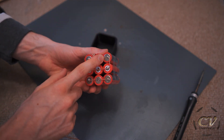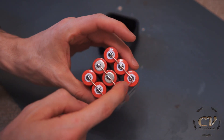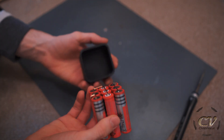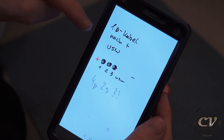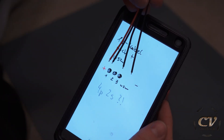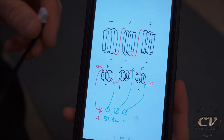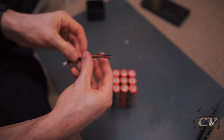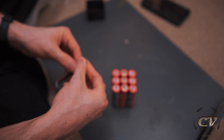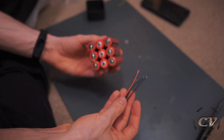Now I need to figure out how balancing is done. I think I need to connect a four-pin balancing cable to the plus pole, then the first balancing pin, second balancing pin, and minus pole. So let me do a bit of research. These are my notes: plus, one, two, three, minus. I did this while I was at my granddad's to understand what I did wrong. There are balancing circuits out there, but I don't yet understand if they are necessary. I'll try without one for now — I ordered some, so in about a month I'll have them. My granddad mentioned parallel cells, and I reckon if they're parallel you can treat them as one cell. So parallel batteries don't need BMS. Also, these BMS circuits are more like a safety feature — in my case I'll just charge it and only use maybe 10% before charging again, so I don't think I need one necessarily.